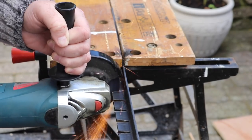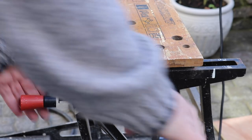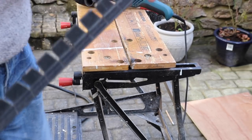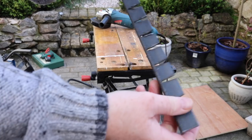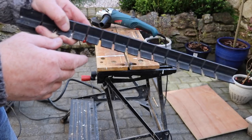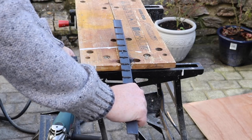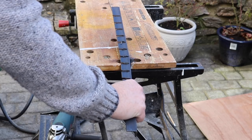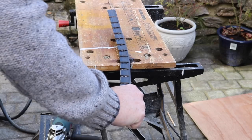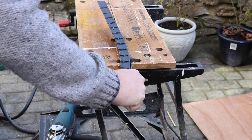Doing a similar thing to what I did with the angle iron for the box — you can see part-way cuts on each side. It just makes it easier to bend; otherwise you wouldn't be able to bend it. It's 3mm thick and one inch inside. On each of the cuts I gradually pull and bend it — I didn't pull it fully closed straight away; I wanted to do this gradually so it became an even bend all the way around.